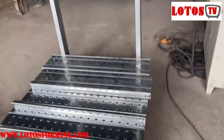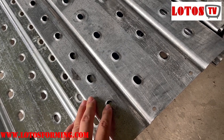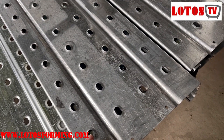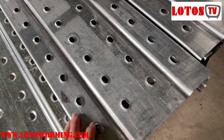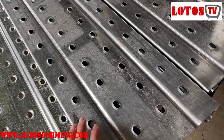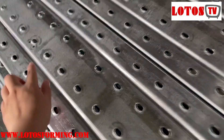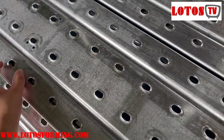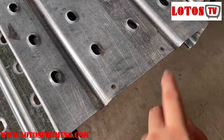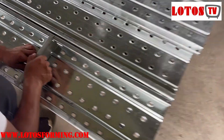Let's check the product coming from the machine. This is what we call a scaffolding board. The punching holes are not simply slotted — the edge is a little bit higher than the surface. The main function is anti-slip, because outdoors there is rain and snow, so these holes help prevent slipping. The two middle holes are for the stiffener in the back, and the side holes are for hooks. This will be used for the rivet and cap, jointed with the stiffener.